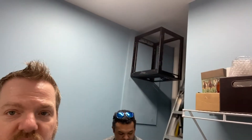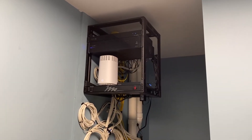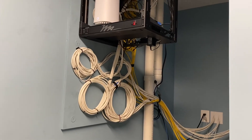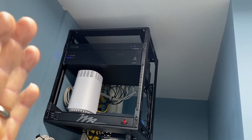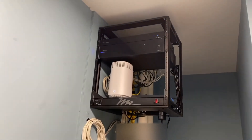The next step is to swap the equipment out of the old rack and put it up in that rack, then wire it up. The rack is completely mounted with plenty of room for the cables down here. I've got all the low-voltage cables in the back dressed on the left side and all the high-voltage cables on the right side.